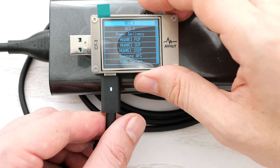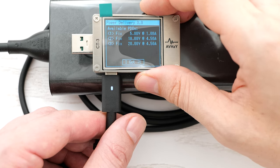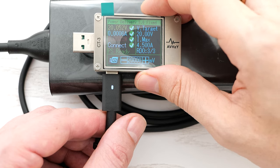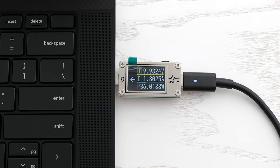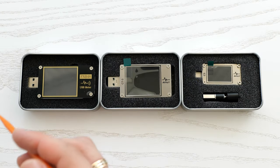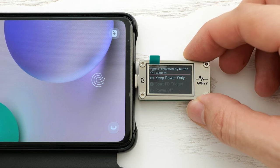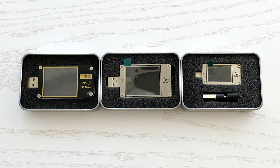But anyway, we can trigger some power delivery modes. Here's the list of available options, so we can easily switch the power supply from 5 to 18 or 20 volts. And if you plug your charger into the laptop it'll automatically switch to the proper voltage — 20 volts in my case. Here's how much current and power the laptop is drawing. I recommend buying any of these meters — they'll definitely cover all your needs. I usually use this one because nowadays all devices have USB-C ports and you don't need any adapters. This meter has basically the same features as the others, so I hope this video was helpful — thank you for watching.